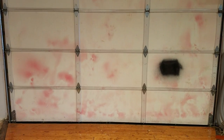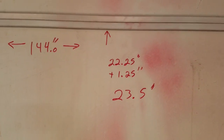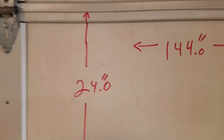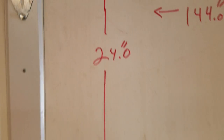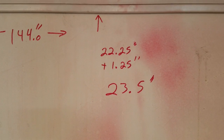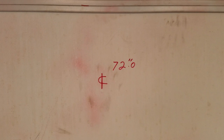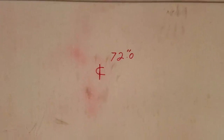All the rollers and hinges have been checked and lubricated with a nice quality lithium grease — they should serve very well. I've established some dimensional lines: I have a 144-inch wide door, 24 inches per panel overall, with an inside dimension of 23 and a half inches give or take a quarter inch. The centerline is established and I've confirmed the door is square in place — they did a good job installing it.